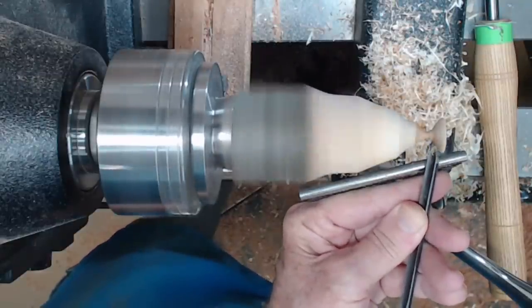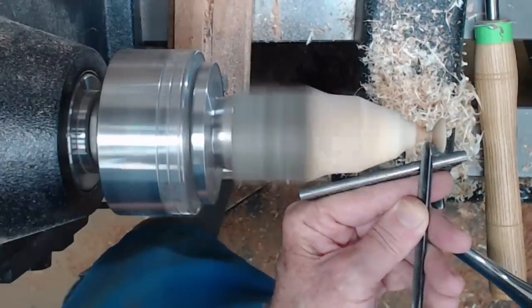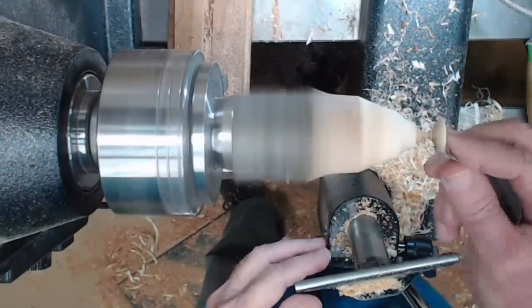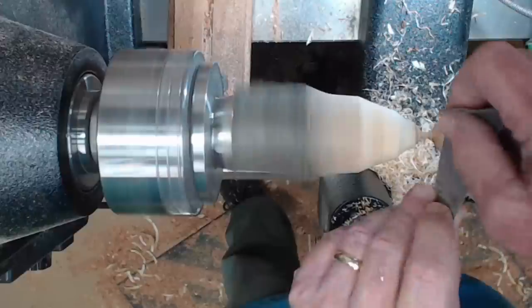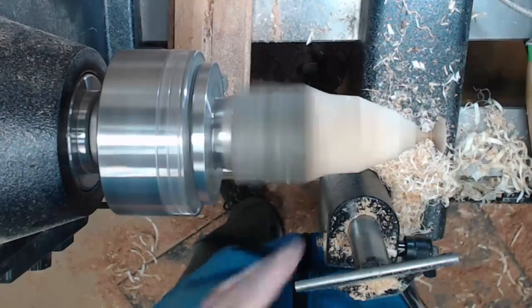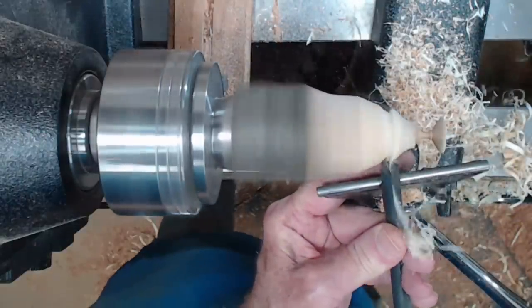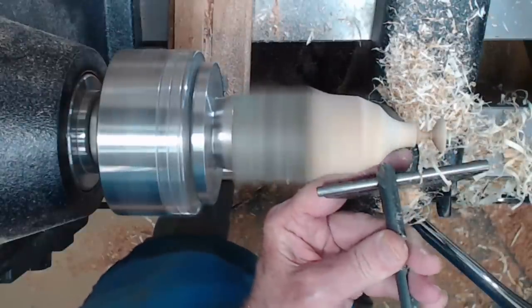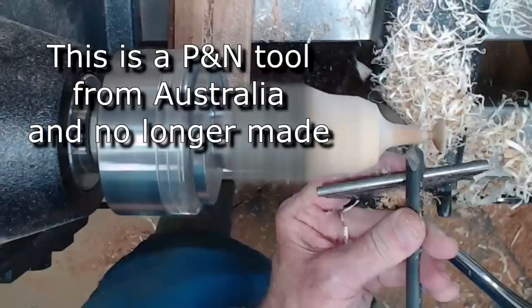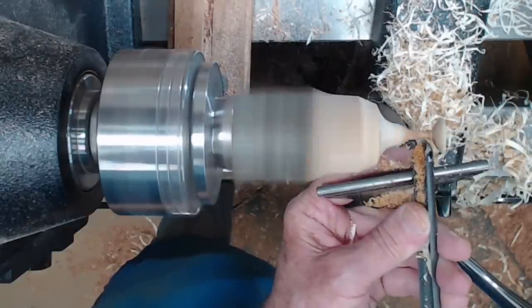I'm going to come back and make this detail just a little bit sharper and more defined — slice in from the back. I'll sand it; I'm going to limit myself to 400 grit mostly, except when getting rid of tool marks on the stem where 120 will do it real quick. This particular tool is almost halfway between the bowl gouge and the spindle gouge. You want to cut toward the headstock mostly, riding the bevel.